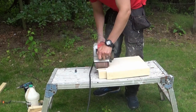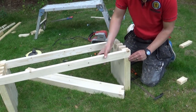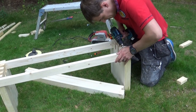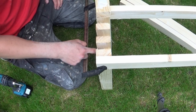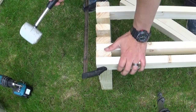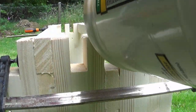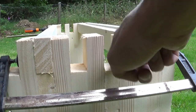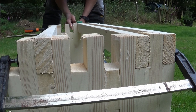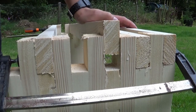Once everything is smooth, it's time to put on the top. Start at one end, cover it in glue — there's no such thing as too much glue, but use common sense. I found it easier to place one of the lengths randomly first to hold the legs vertical while I fix the front end, so it doesn't fall over. On the outside pieces I screwed through the face to create an extra strong point, since when you pick the bench up you'll likely grab the outsides which would only have two glued faces — that extra screw creates a much stronger bond.